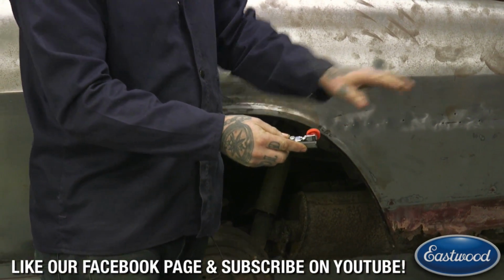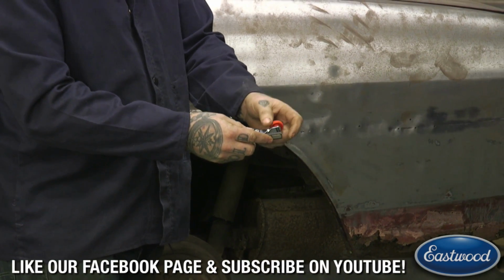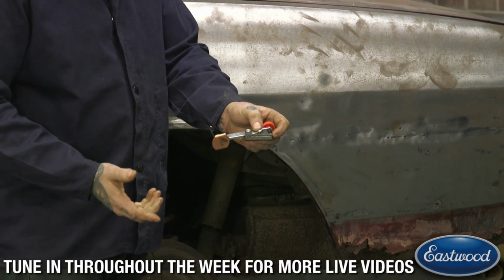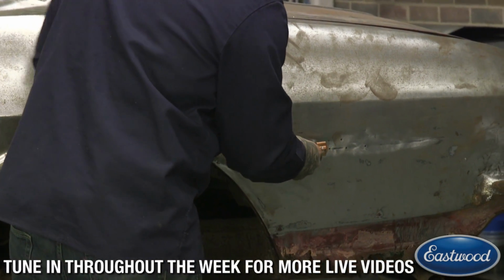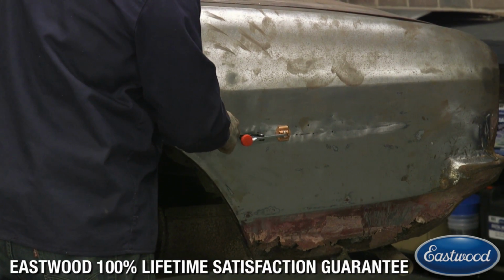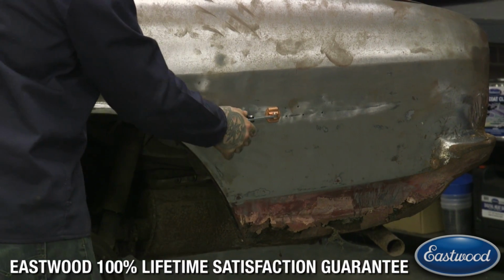So you can make this fit a panel that's curved. By adjusting this screw, it'll change the angle of the magnet and how the copper section touches. So it'll actually adhere a little better because it's conforming to the panel. And that magnet's really strong. Even there, it's only touching maybe an 1/8 inch of the magnet. So we can adjust this down.